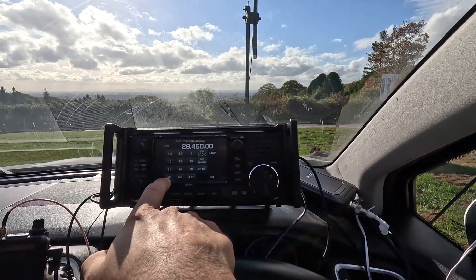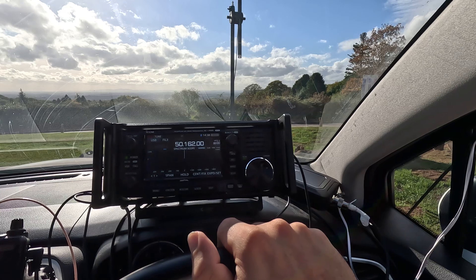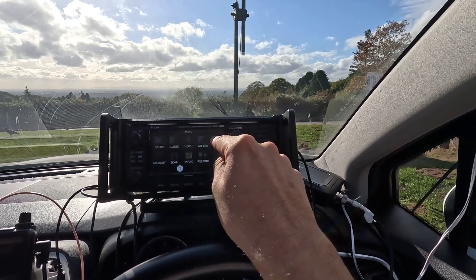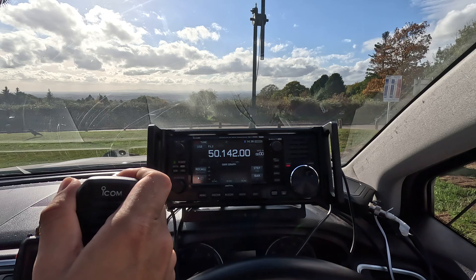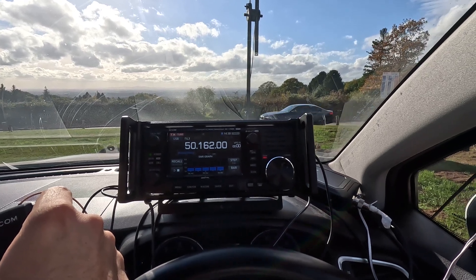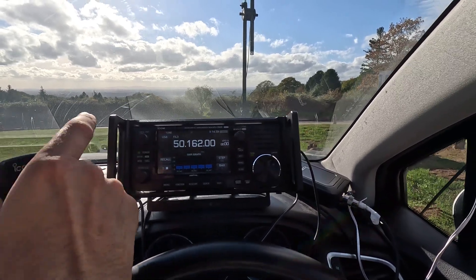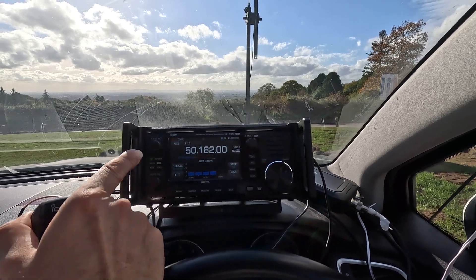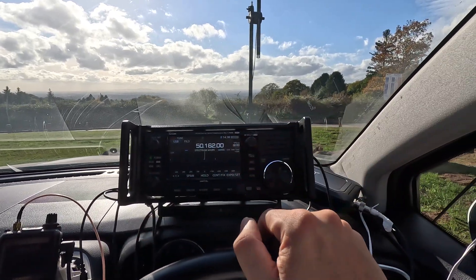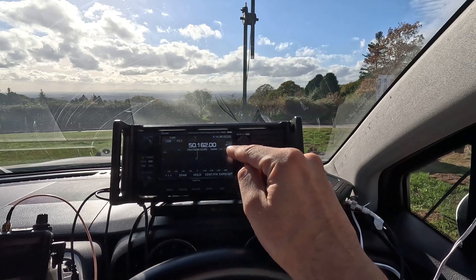I love it. Now let's go to 50 megahertz. I've tried this before — not many stations are active or it's not picking up. Maybe this antenna is not really ideal for this band. But hey, let's check it. High SWR. Watch this — oopsie, that took long. SWR down. That's amazing. And look at that — I can hear people now. I may not use this antenna to transmit on 50 megahertz.